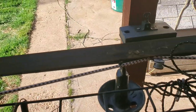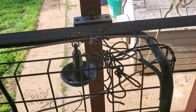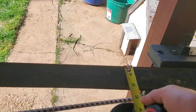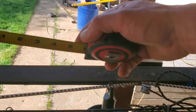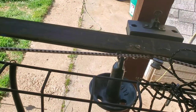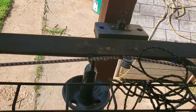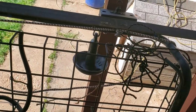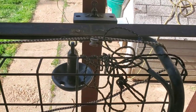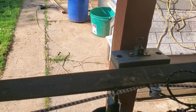I'll have to measure it. I need a minimum of 19 inches on that strap and I don't know if I can weld it together and make a tall enough strap. I'm trying not to spend any money here. It's two inch - it's 41 inches long, that might be an option of cutting it in half. Actually, I'll have to cut an inch off of it then cut it in half and then weld it together on both sides. That might be an option. Actually, I had another use for that and I really don't want to use it for this. I guess I'll just have to go to the metal store on Friday with all my other errands.